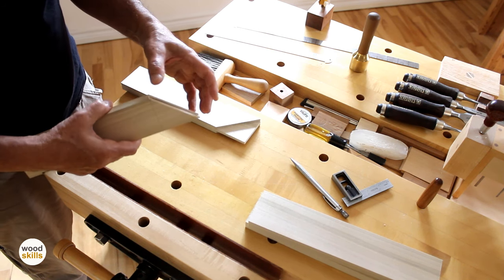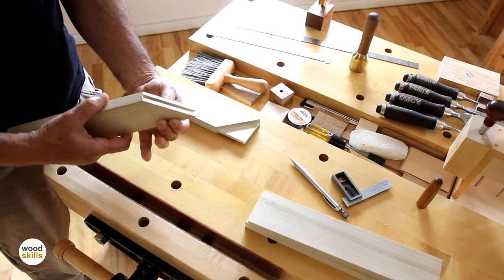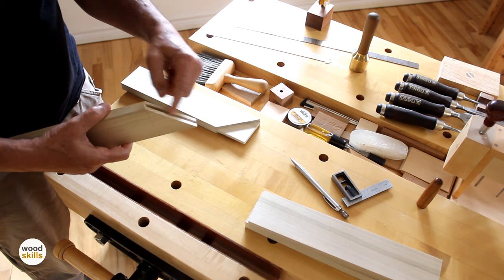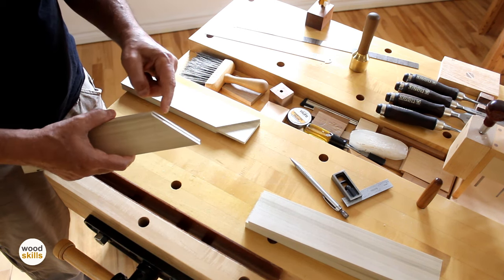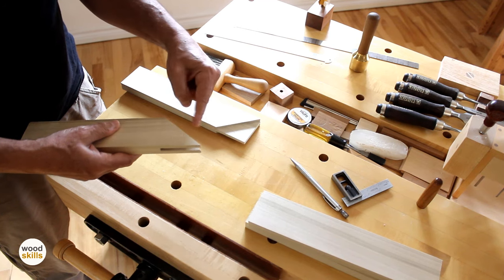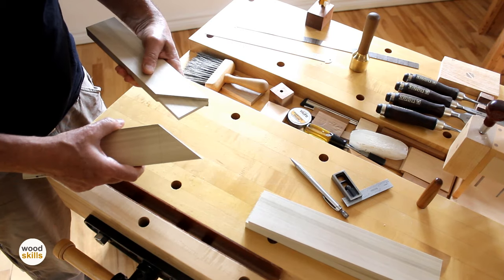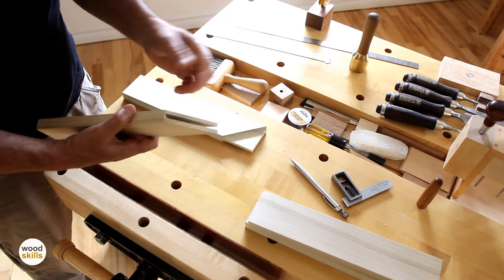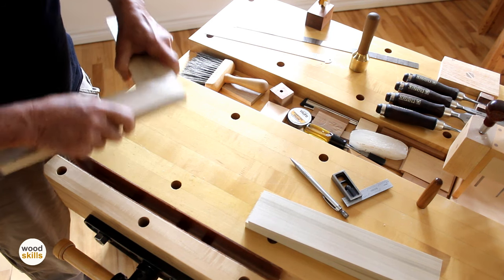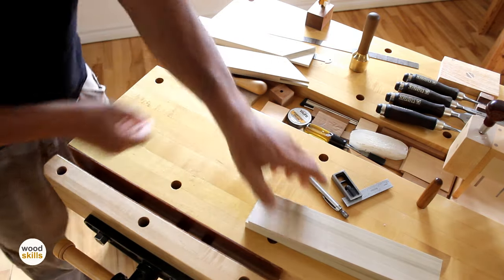This allows me to remove the waste from the mortise using chisels. By keeping that portion solid at 90 degrees, I have more wood to work with and more support for the walls of the mortise while I'm chiseling. If I cut the 45 before, it would be more difficult to remove the waste. Because it's square, I can flip it over and use the square component against the bench dog. Then I just clean the bottom of the mortise out and the joint comes together.